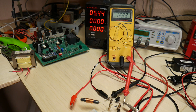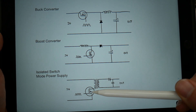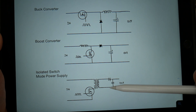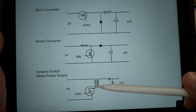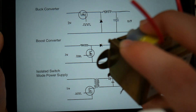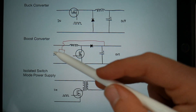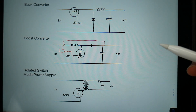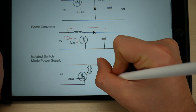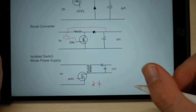This is the third type of switching power supply: the isolated switch mode power supply. We have a transistor switching on and off a transformer. Depending on the winding ratio and the duty cycle, we can control the output voltage. This is different from a typical AC transformer because we're working at higher frequencies, so the transformer can be smaller and have the same efficiency as a larger 60 Hz AC transformer — these circuits operate at around 20 kilohertz. It's important to have a feedback mechanism that reads the output voltage and controls the duty cycle to keep a constant output. Where isolation is needed, that feedback can be controlled through an opto-isolator, which connects an infrared LED and an infrared phototransistor, allowing control while maintaining electrical isolation.